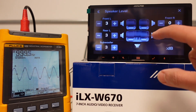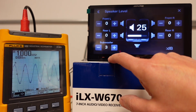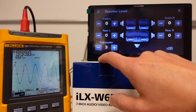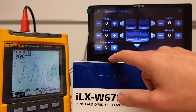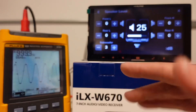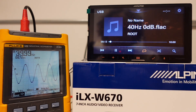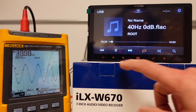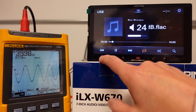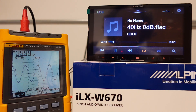If you're going to leave your speaker level at zero and just do your plus three on the sub, then you can put your volume a bit higher. It's starting to get a little weird at 25, but 24 looks safe at 7.95 volts. It definitely really starts clipping at 26, so 25 is maybe borderline depending on the track. I'm going to err on the side of caution — it's just thickening up on the bottom there and I'm not sure if that really is clipping, but 26 is obvious clipping. So: 24 if you're leaving speaker level at zero, 22 if you're going to do the plus three thing.